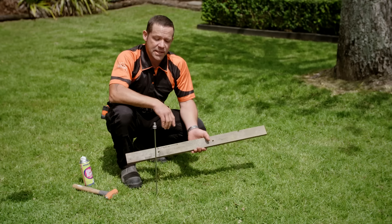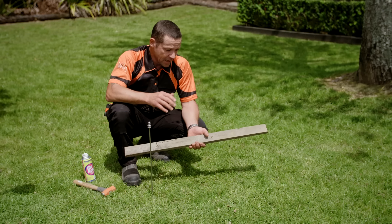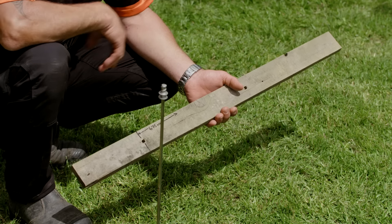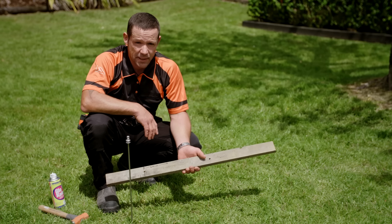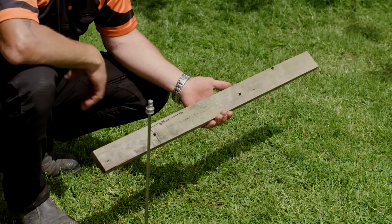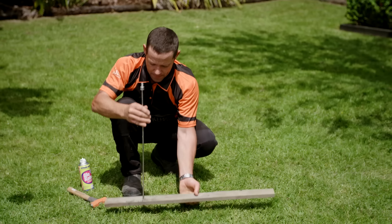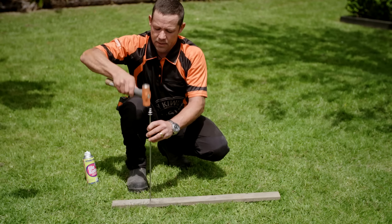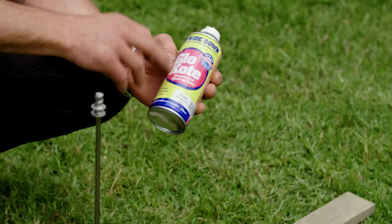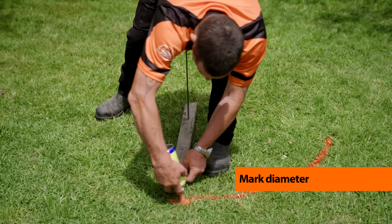The next thing I'm going to do is start marking out a circle, so I know exactly how much soil to take away. We have an overall diameter of 1350, so half of that is 675 millimeters. I've marked from the end of our stick 675 millimeters and drilled a hole. I'm going to use this stake, put that in the middle, and hammer that in — so 675 is now our radius. I've got some upside-down dazzle spray to mark out our perfect circle and start digging it out.